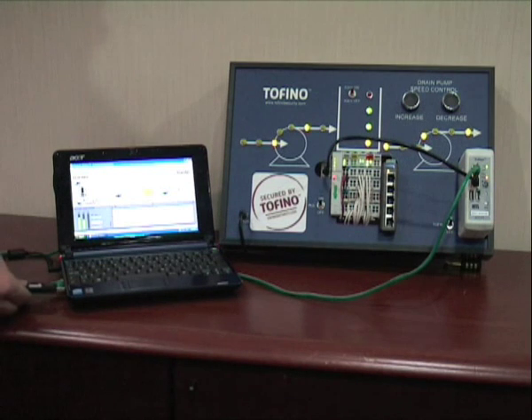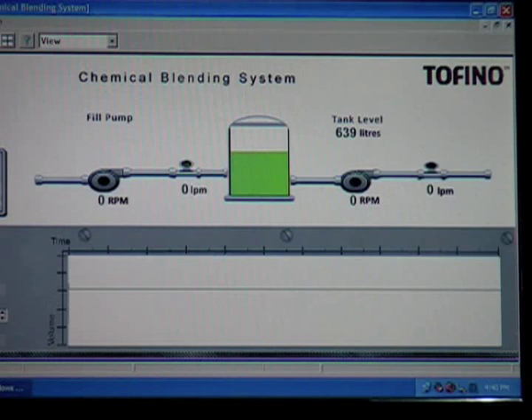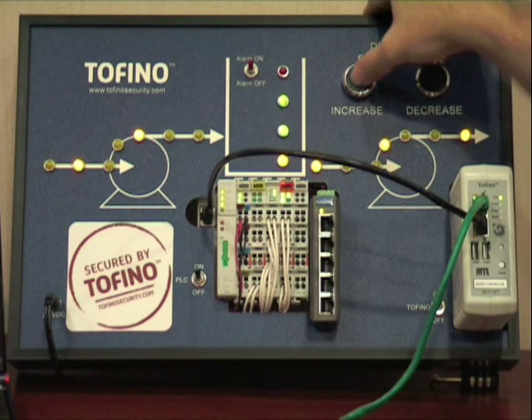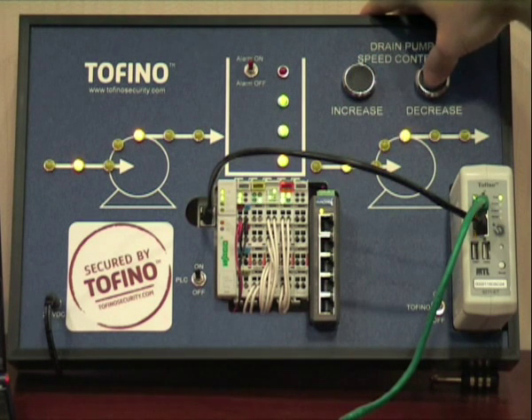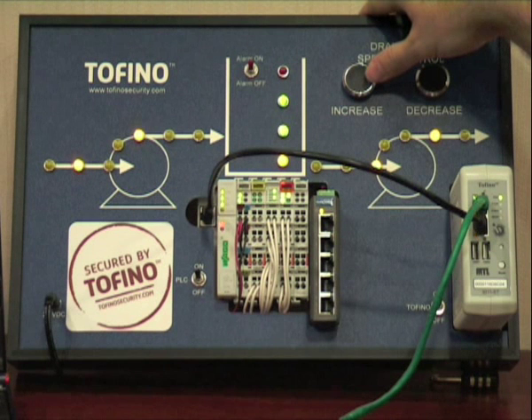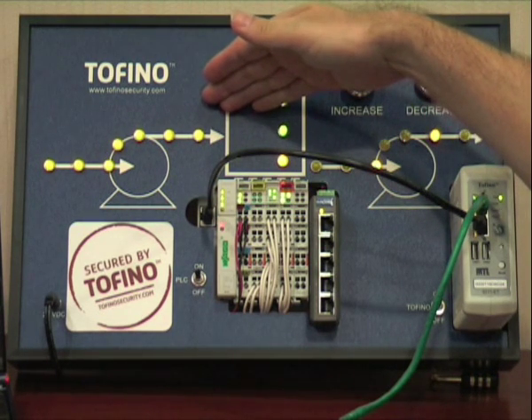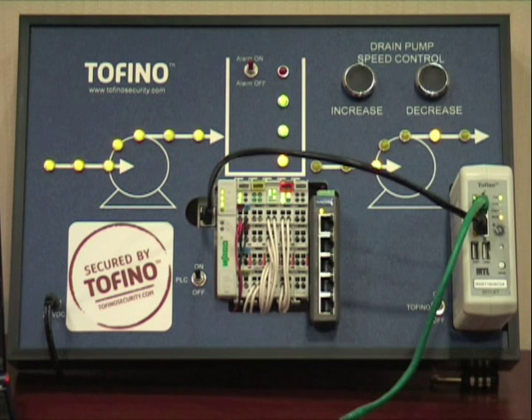I am now inserting the virus into the notebook computer. The HMI at that point is already frozen. Even pressing the increase or the decrease button will not affect our HMI anymore — we see a stable picture. In the next stage the speed of the inflow pump is programmed to a maximum. We see all the LEDs running at high speed. The tank level will fill up and eventually will over-spill the tank. We can now hear the alarm.